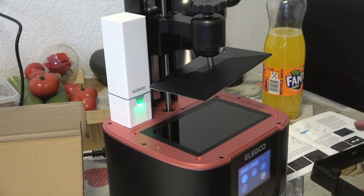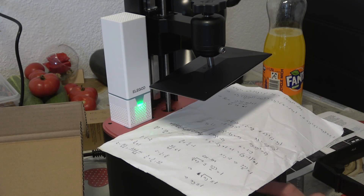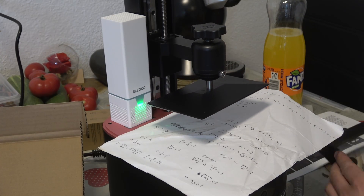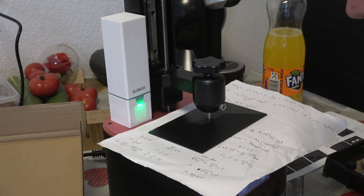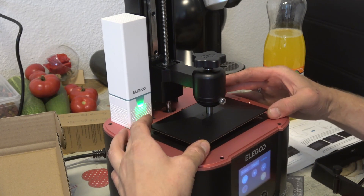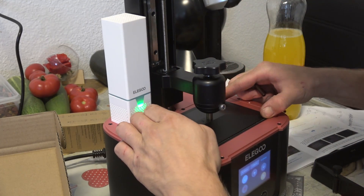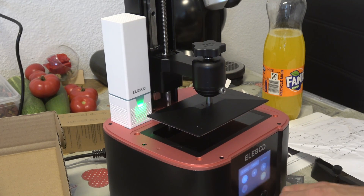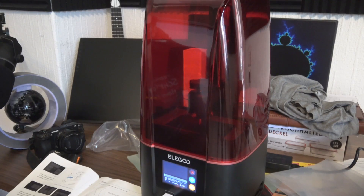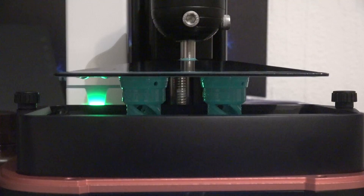The noise you hear is the peak loudness of the printer, so the machine in and of itself is really quiet. To set it up for the first time, I first level the overhead printing bed and then install the tank which will be filled with resin. Here's how the printer works: the bed goes down into the tank touching the foil, UV light is then projected onto the bed layer by layer, curing the resin in the process. After repeating this procedure hundreds and hundreds of times you end up with a fully printed model.